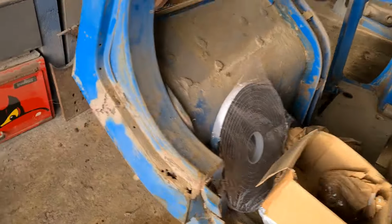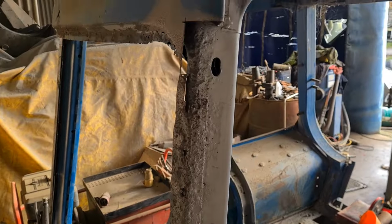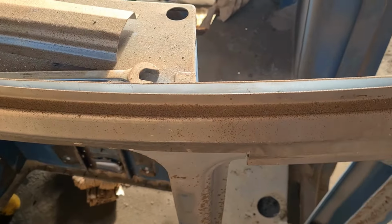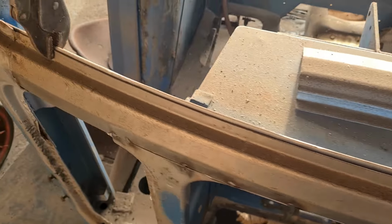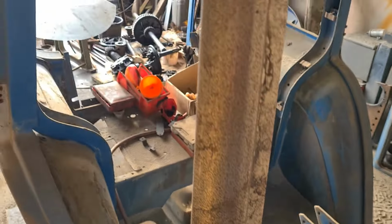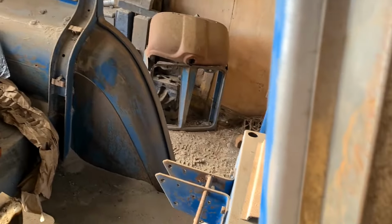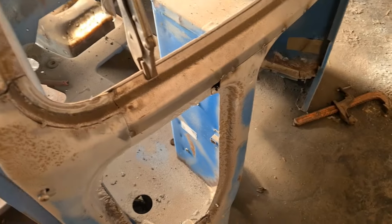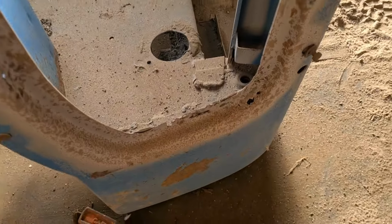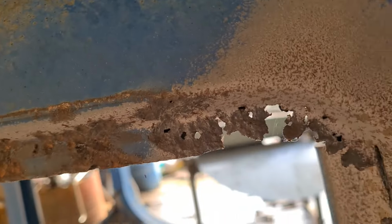Well, this is for the 9.6, been an ongoing restoration for a while, but doing the corner post. Look, fair bit going on there, and that bit all done. Just got to be welded in. Got that one on. All sits in there for us. But yeah, a few more repairs to do in and around there. Same with that one. Look, it's got a few bits and pieces wanting doing. And same with a bit for the window there.